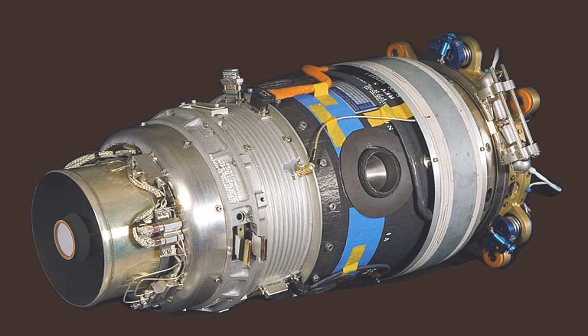The two-color IIR seeker, or infrared detection system's components, are assembled in a series of operations separate from the rest of the missile's construction. Circuits that support the infrared system are soldered onto pre-printed boards. Extra attention is given to optical materials to protect them from excessive heat, as this can alter the missile's detectable wavelength. The assembled infrared subsystem is then set aside pending final assembly.